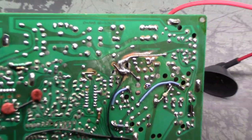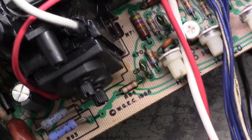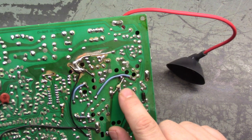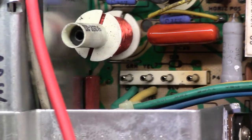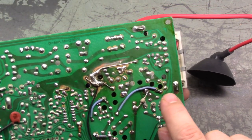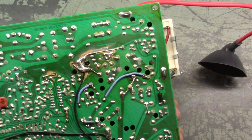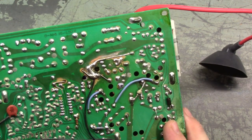This is the early version of the K7000 — the 1986 version. There's a 1990 release and a 1986 release. The 1986 release has a factory mod that puts a big capacitor across the posts. D18 is actually on the bottom side of the board — it's supposed to be right here. I'll bet dollars to donuts that the cap missing from here is the reason for the width problem, since it says too narrow. C38 is the cap that controls horizontal size.